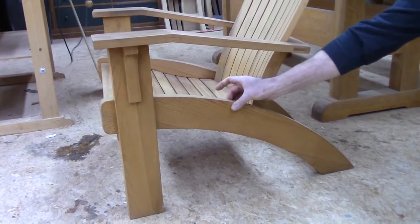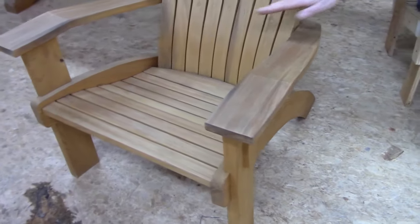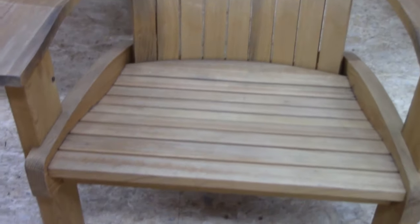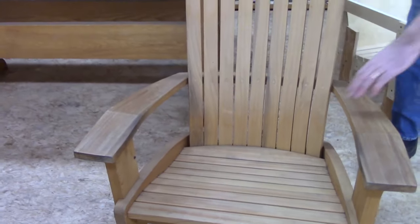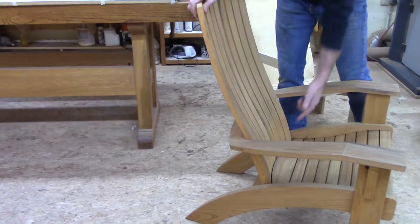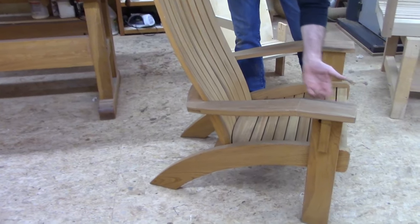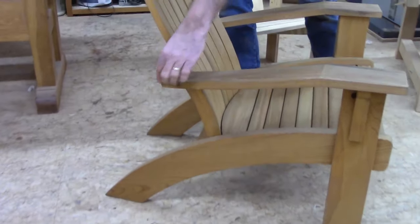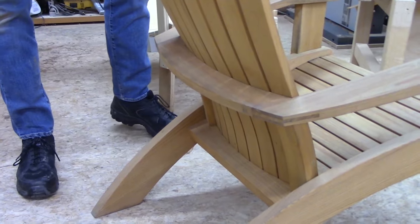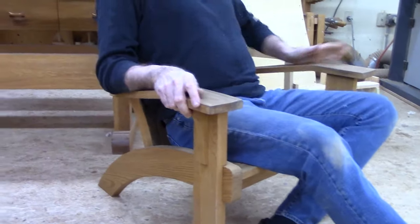By making that thicker rail, I was able to house the curved line of the slats so it has a clean look on the outside, but they're fully inserted into mortises on the sides. It's a great chair to build, though challenging. Everything's not screwed together — the only screws are just tacking the back slats in place, which I plug. The entire arm assembly has no screws: there's mortise and tenon, a spline joint, and a big bridle joint in the back corner. Super strong. When I finally built it and sat in it, was that rewarding — and it's the identical feeling to the mock-up.